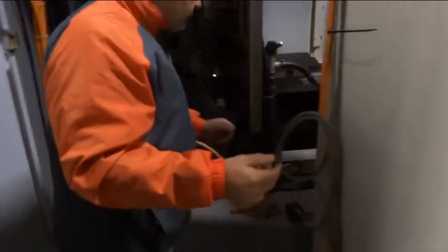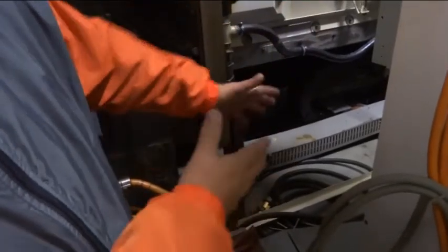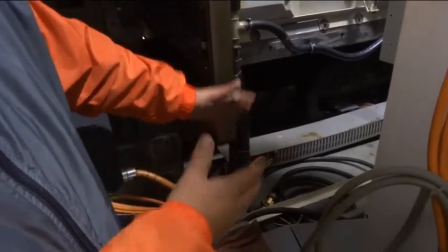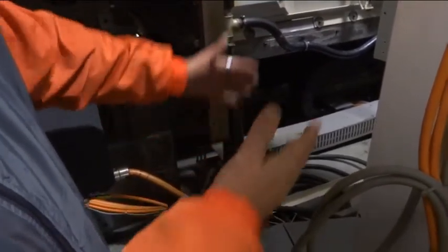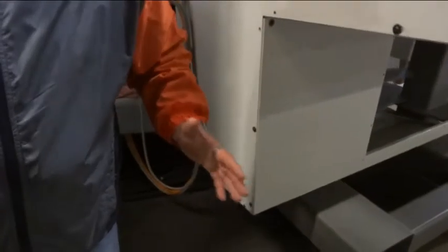The tool changer is a separate part here, and that comes off separately, right? Like we talked when you guys saw the machine. All the cabling, etc., we lay nice here inside the machine. So when you get the machine, you have it leveled, you put all the cabling out, put it all on the floor so you see what you have, and then you can start to plug in.